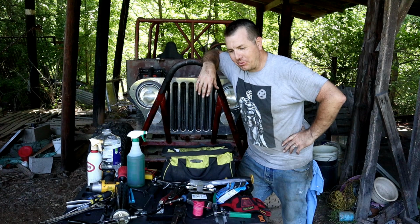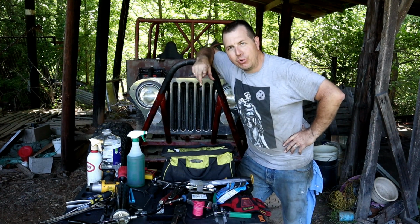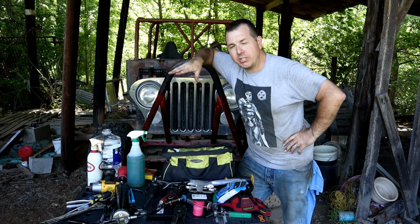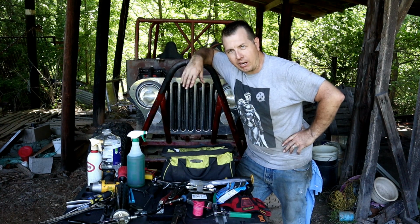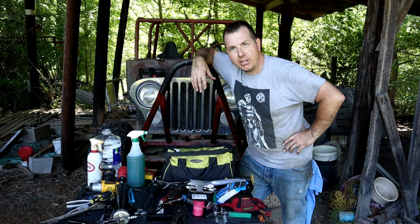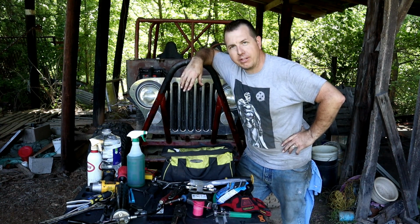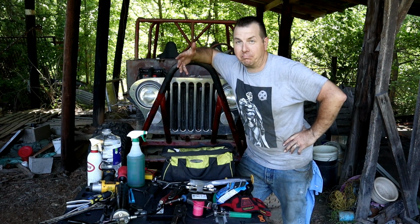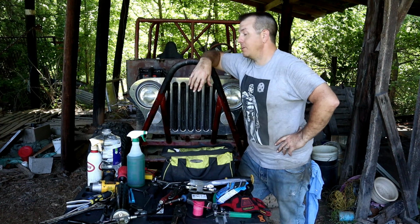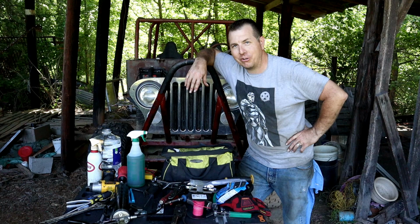I mean, like I was saying, hope is not a solution. Going through all of these steps that you need to do, what I just did there, to get good fuel to the carb, get all of the varnish kind of worked out of the carb, turning over the engine, using the penetrating oil, using the fuel additives. All that stuff is what makes a successful restoration project, I guess. But you could hear there, she is fully awake and ready to run now.